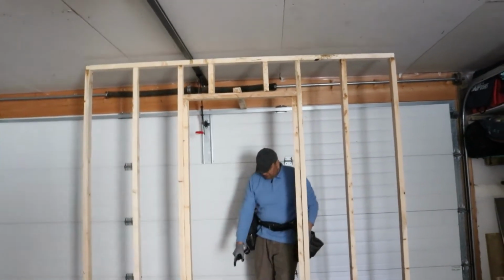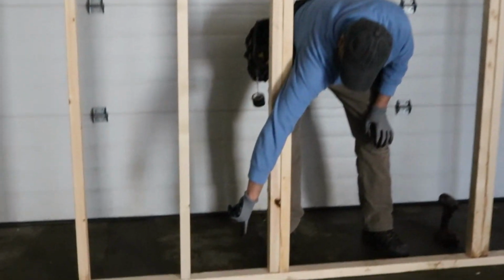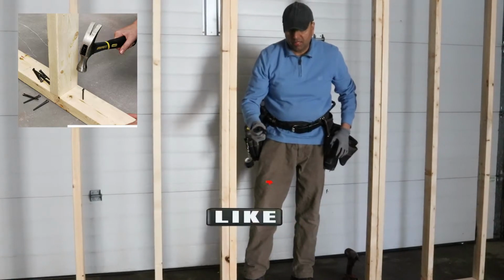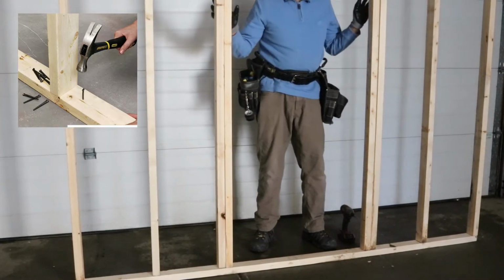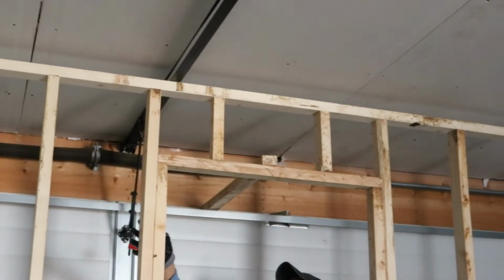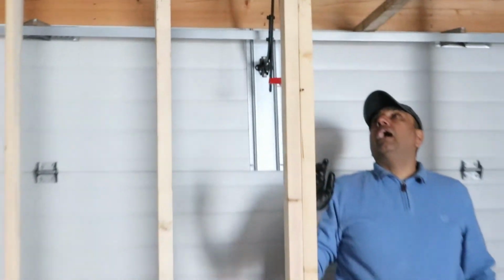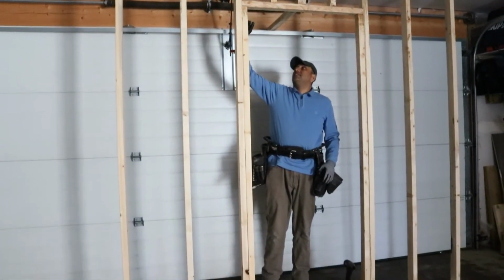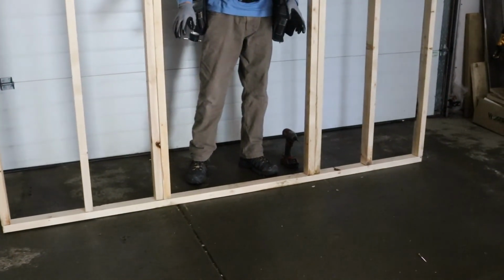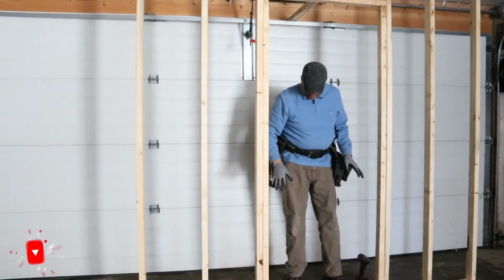Now, the bottom plate here, when I do my nail in place, let's say I put my nail over there, 1, 2, and I use my concrete nails with the bullet gun, or use a concrete nail with a little heavy hammer. I put one nail there, and when my wall is pretty much stable and strong, I put some nails on top. Every situation is different for the top, but I'll have some clearance, about a quarter inch from there. So make sure that I will not tie too much to my ceiling, and I'll keep about a quarter inch away, and I use my longer nails. Once it's stable on both sides with my nails in place, I'm going to cut it from here, so this way I can install my door.